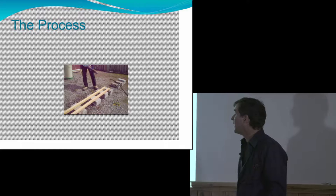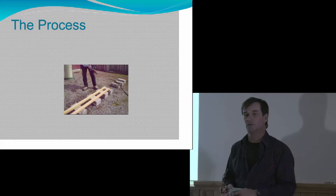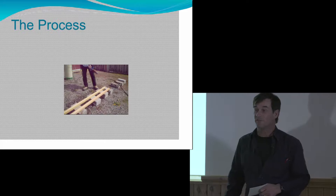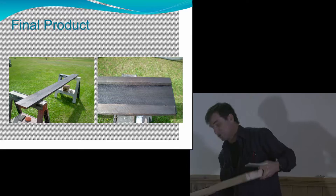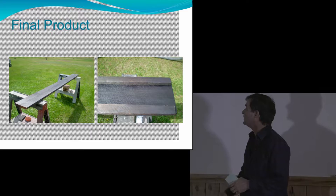I had nice little videos of actually torching the battens from my vertical board and batten, because I actually wanted to try this system on one of our small buildings. It took an awful lot of convincing for the park superintendent to put burnt wood on his building — he was worried about it falling off. We managed to do that and this is the sort of effect we got. I draw your attention to the battens and how they look. My point is: when you torch it with a propane torch as opposed to the chimney method, you get different effects, and I think the final results are going to be quite different.